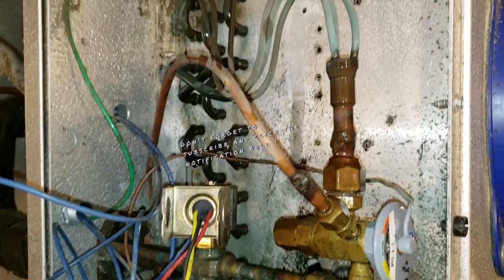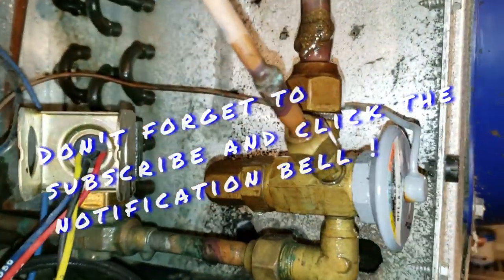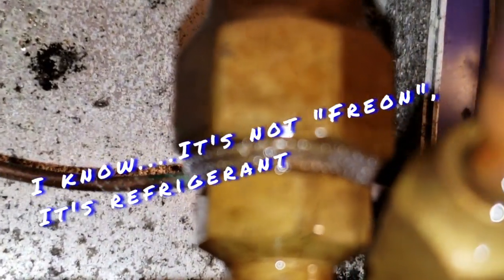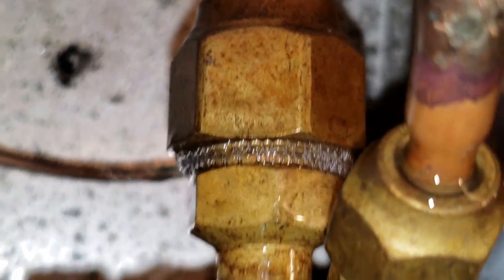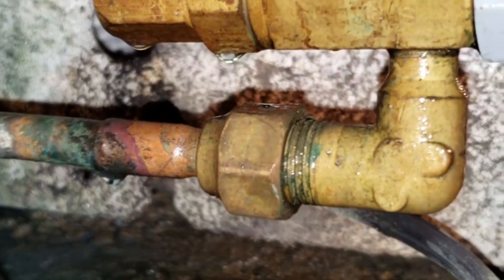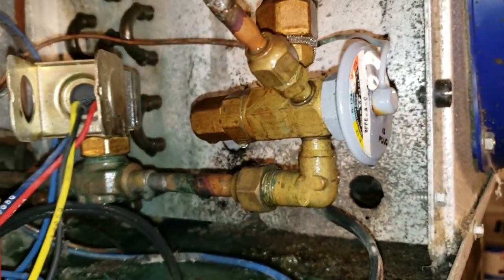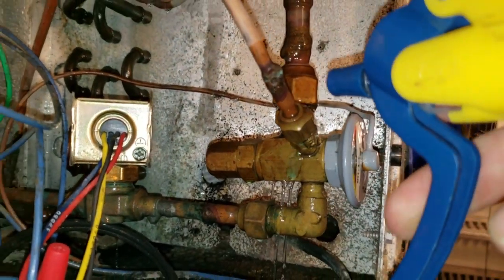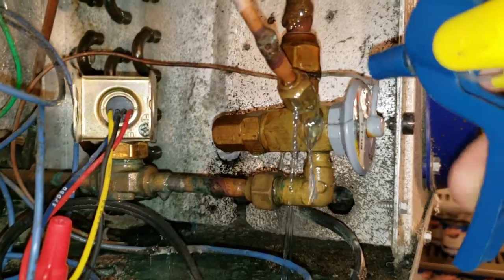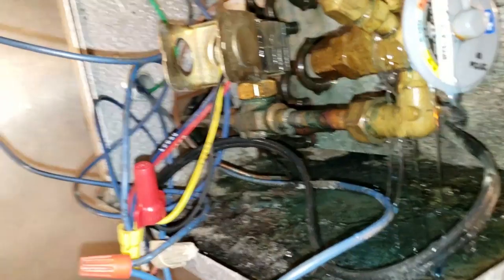Alright, the compressor was short cycling on and off and there wasn't really much refrigerant worthwhile to keep. Unfortunately it's 414B. I could see oil down here more than anywhere — that's where the detector was picking things up. It looks like I didn't have enough pressure to confirm at first, but doing a quick search, that's where I kept picking it up with my detector. Boy, we've got all kinds of leaks.